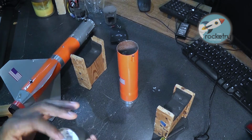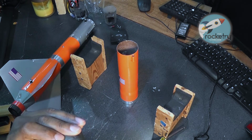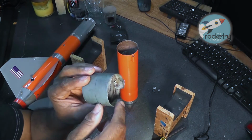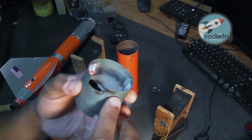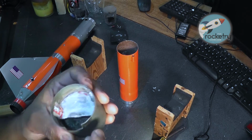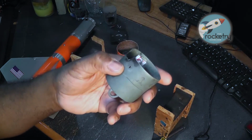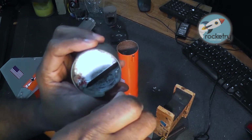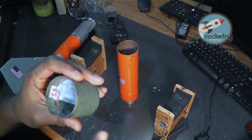The way I go about doing this with the JB Weld is I'll cover the T-nut in JB Weld, and also a little bit of the coupler. Then I run the screw through to get it nice and tight with the JB Weld in there. I would grease the screws. That's the trick here: I grease the screw down so that as the JB Weld cures and dries, it doesn't stick to the actual screw, and so when I back it out, it comes out nice and neat.